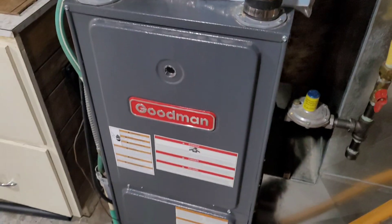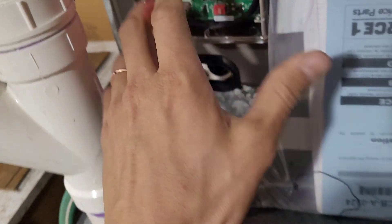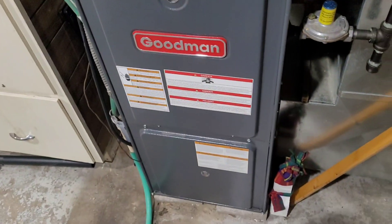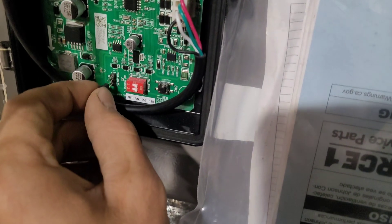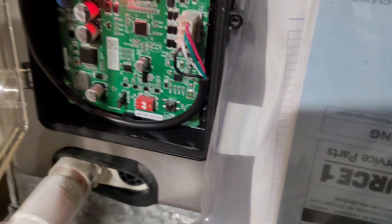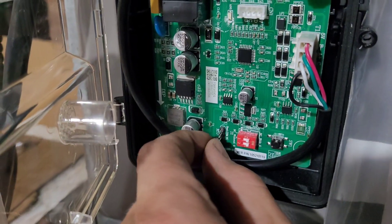We're going to also test it in heat mode. Alright, so we just turned it on in heating mode. You can see the burners have lit — in a moment the blower will come on. But same thing: if we pull that test pin and move it down, it shuts everything down and just runs the fan. So we removed it and moved it to the test pin — it shut the heat off, and it should just leave the fan on. It is indeed operating as it should.